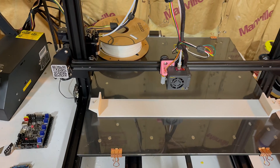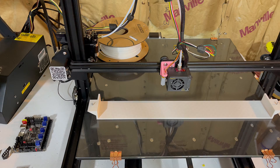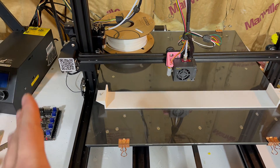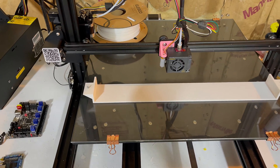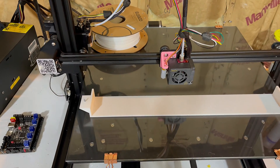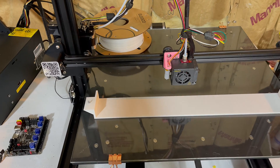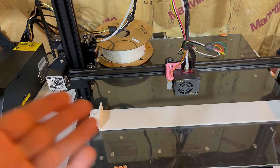So what's next? It's really difficult. If you have this printer, obviously getting Klipper on here is going to be a game changer in terms of being able to leverage the entire bed. You can leverage input shaping, or resonance compensation — which is the same thing, just a different name. You can leverage flow rates, which is usually like linear advance, and then you can just configure your extruder to print a little bit better. This is a little bit wispy, probably because of the very long Bowden tube.